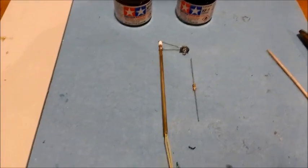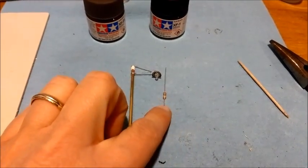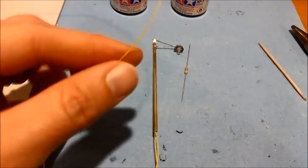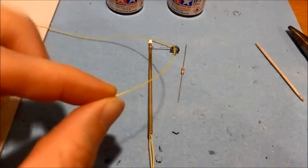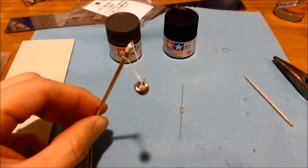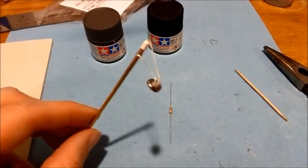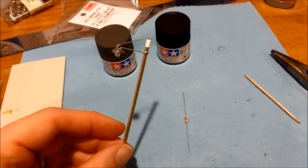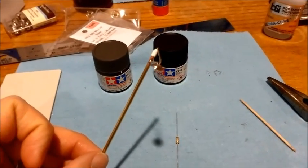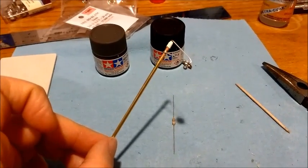That's pretty much how I go about creating a lamp post. What you need to do is solder the resistor to either end of the wire — trim the resistor leads and attach the two ends to the wire. Then you paint the top of the lamp post a flat black, since the LED is going to be shining through it. Allow that to dry, then paint the color of the lamp post you wish — black, dark gray, or brown. I went with dark gray.